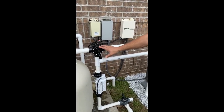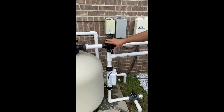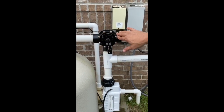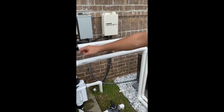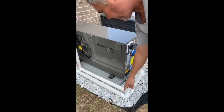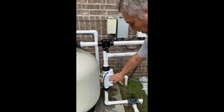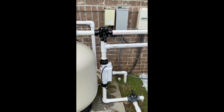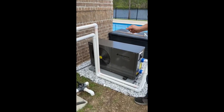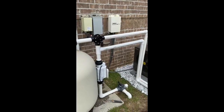We've connected the plumbing. This is the bypass — the inlet. The three-way valve works like a T and directs flow at whatever rate we want. Right now it's a flow-through: everything goes through and bypasses into the heater from the bottom. The water heats up, comes out through the top, goes back and taps into the same line. We put everything before the salt water generator because we don't want excessive chlorine going in there and ruining the gaskets. The heater is saltwater-proof, chlorine-proof, and chemical-proof — it's not a problem — but gaskets wear out in time, so for that reason we tap before these things.